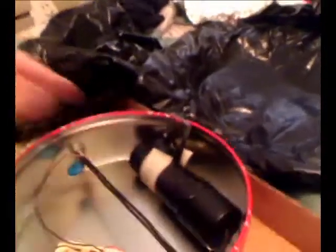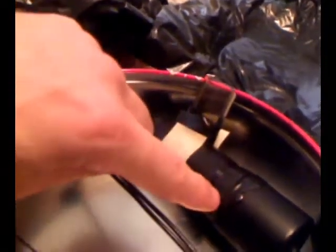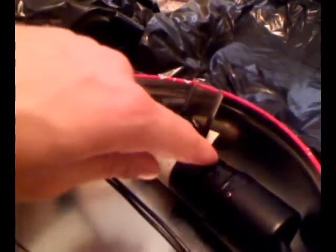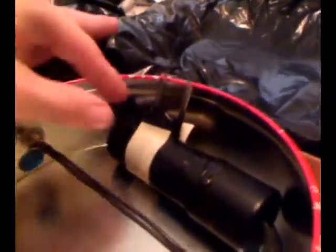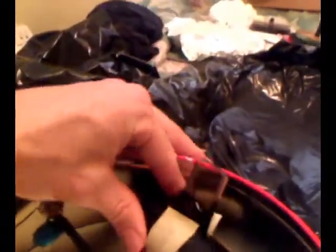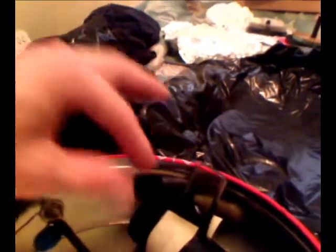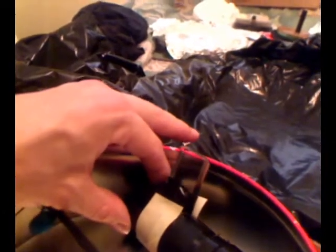I took the time to put electrical tape around where the two pieces join. That allows you to rotate the tube just a little bit, the two pieces, and then lock it in the position for best sensitivity. I believe it came from a PET scanner, but I'm not really sure. That crystal — almost for a fact — is a barium fluoride crystal, almost certainly from a PET scanner. I got that on eBay as well.